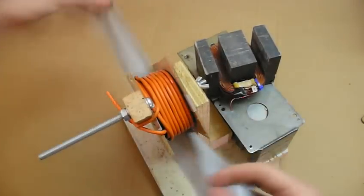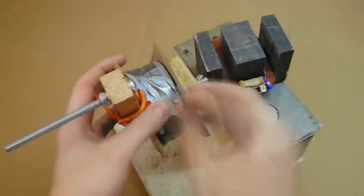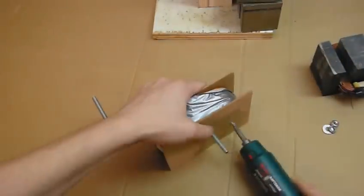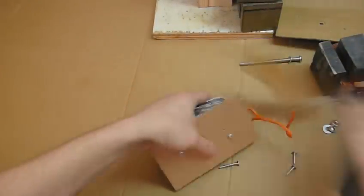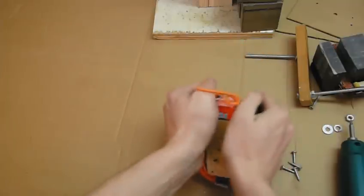When you're done, slap a big piece of duct tape on the outside of the coil so it doesn't shift on you. Then tape down the cardboard strips. Unscrew and slide off one side of the bobbin, holding the coil in your hands in case it tries to spring. Hold the coil on the edges with your fingers and push the rest of the bobbin out.